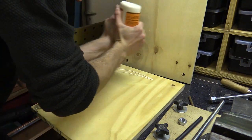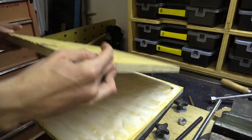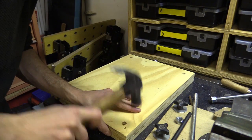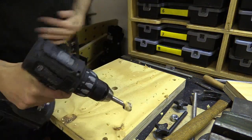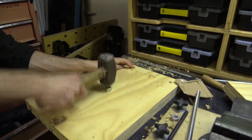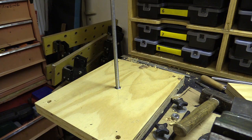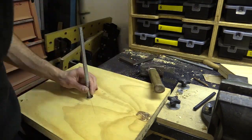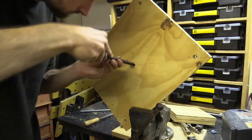I now need to bed an M12 stud connector nut into the top pieces of the press. I first glued and nailed them together and then drilled a hole the same size as the narrowest piece of the connector nut — this was about 18mm. You could use a threaded rod with washers to push the nut into place but I decided to use a lump mallet. This was a bit silly because the nut went in at a slight angle, so I had to take it out and file two opposite surfaces to compensate. If this is not square, the plunger will snag on the threaded rod columns.